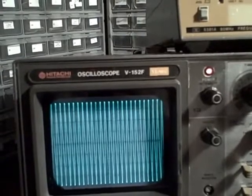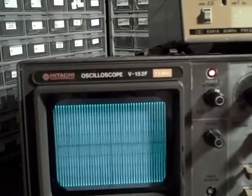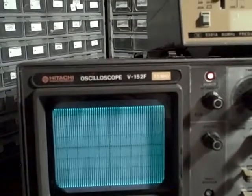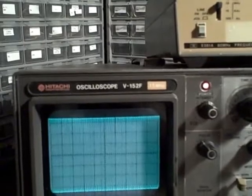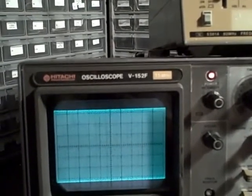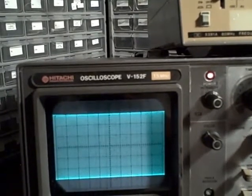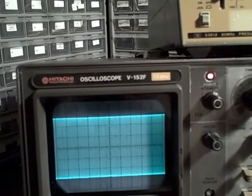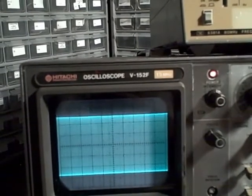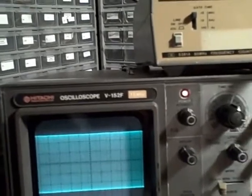Now it is falling right now, but very slowly. We'll pick up speed as we get closer to the frequency — you'll see it falling faster. I want to go to 2.8 divisions; that's the magic number for 3 dB. I'm going up to three divisions, and then we go to 2.8 right about there — 2.8 divisions up and down.